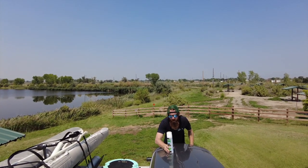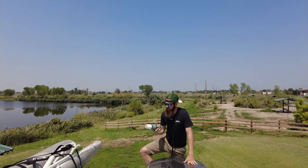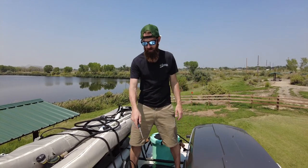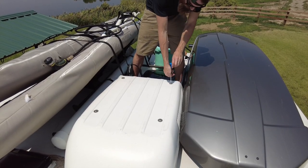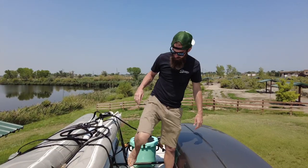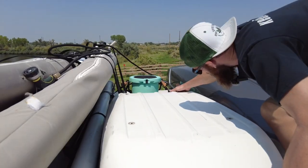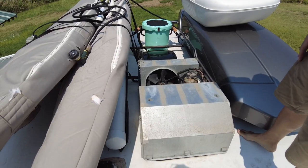For the top portion you're going to need your coil cleaner, a hose, and a Phillips head screwdriver. Notice these four screws on top — go ahead and undo those screws and put them in your pocket. This top cover should come right off. There's your air conditioner.